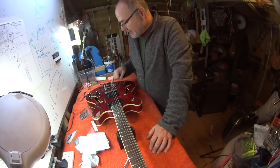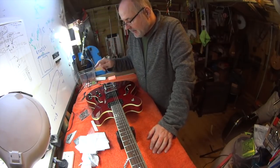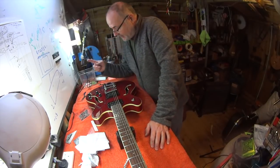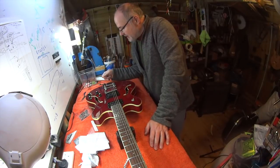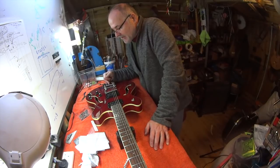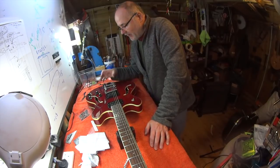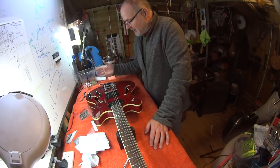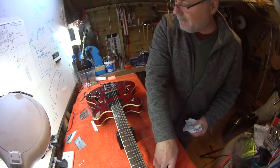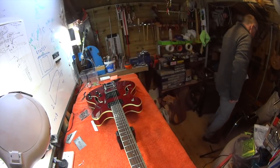Yes, you need these to be, this one's moved off the line. You want those to be in as straight a line as it can be. But your critical thing is what the geometry of this is doing. So for example, you need this to line up as close as you can. But if this thing has a slightly wonky geometry, there's no point getting this to a perfect visual position and slamming that down, because you'll end up with a twist in pursuit of a visual thing, an aesthetic, I guess.